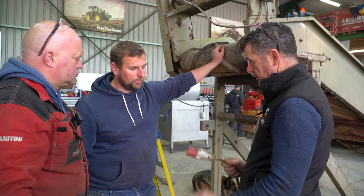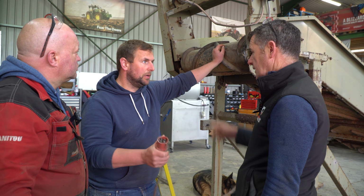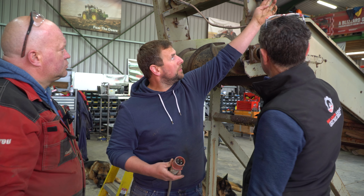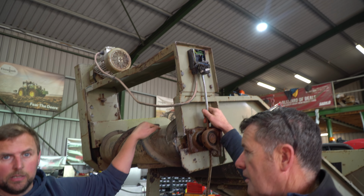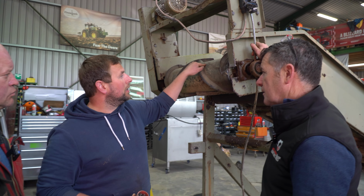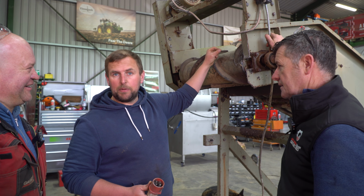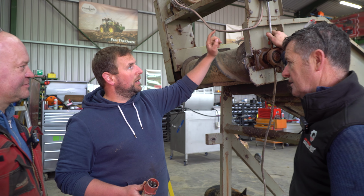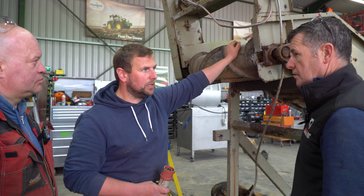So we'll put a five pin on it just for testing it here in the workshop. Yeah. So we need to do that. Put a new stop start on it. We won't have to put a two-way in this because obviously with the Chevron, this belt will only work the one way, and that's it. It'll never run the other way. Never have to. Some of the other belts we have, we put a two-way on it so we can change the direction with just a flick of the switch without having to change the phases here.